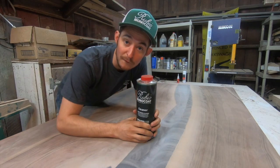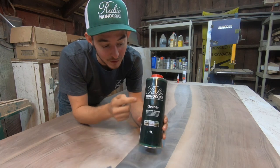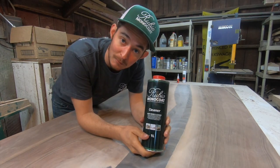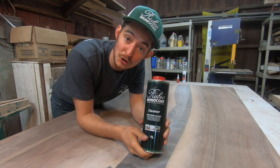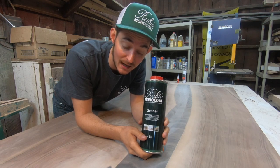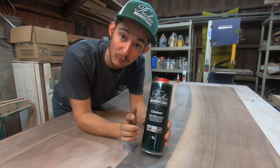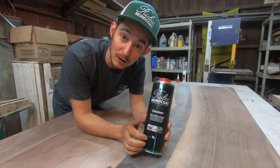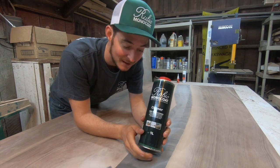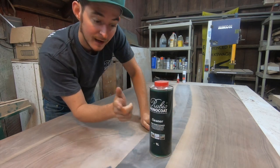All right, so first things first. We're gonna go ahead and clean off our slab, get all the dust and everything off with this Rubio Monocoat Raw Wood Cleaner. And they recommend that you use this. I'm not sure if you can use other things like isopropyl alcohol, but I've used this, works really well, and it preps the wood before you put on the Rubio Monocoat. I'll leave a link down in the description for all the materials and things that I use so you guys can click it and get it. All right, so we're gonna get a cotton rag and wipe this stuff on.